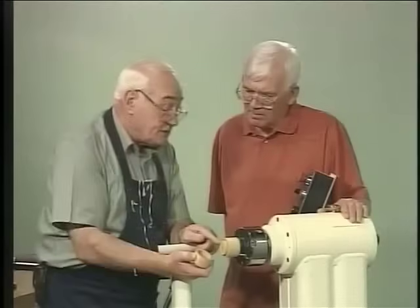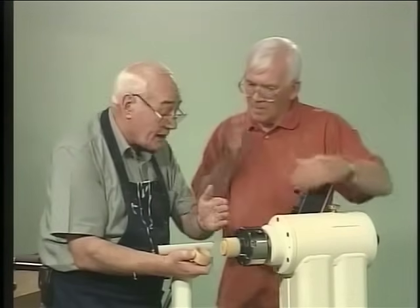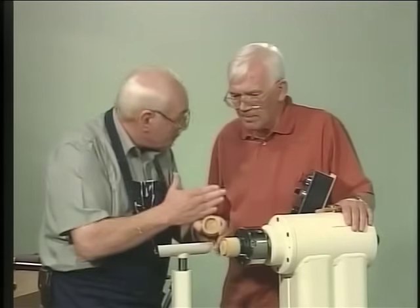Right. The danger is if you take it off this face and you have two or three shots at it, you're moving away from a thread and you end up with a blank piece. You're making it longer as well, aren't you? Yes, you are. Fitting, yeah. But I'd prefer to take it off this one, so we're always working back into a thread.